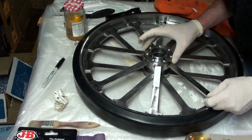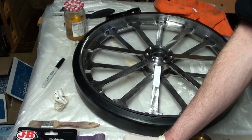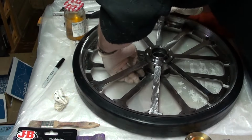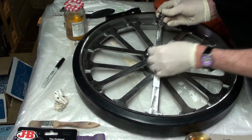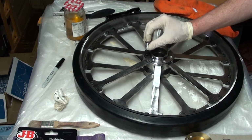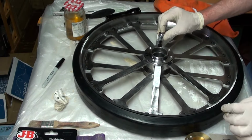On the full-size engines, the hub would have been cast with the spokes to form one piece. The intent with the JB weld is to fill all gaps between parts, then clean up the surfaces to create the appearance of a single casting. The screws holding the outer cap to the center hub were also covered in JB weld, then smoothed to conceal the screws completely.